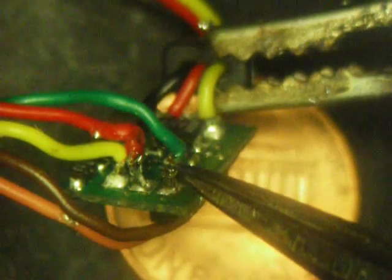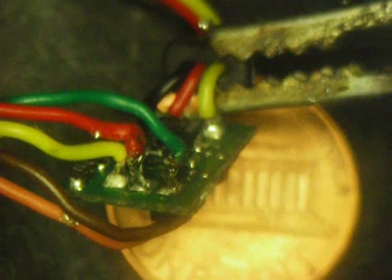All you have to do is solder in two new resistors on the two outside wires. The value of the resistors can be a little flexible. On the internet I saw reference to 2,000 or 22K ohm resistors, but in this case I found that a 4,700 ohm resistor works the best. These are SMD components that I have, but regular standard resistors work just fine — they're just a little larger. I've soldered in these two new resistors on the red and the green wire.